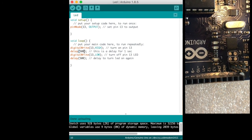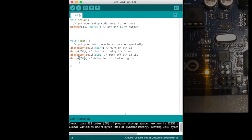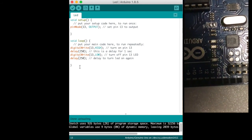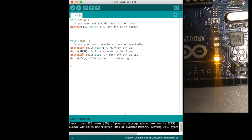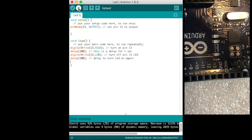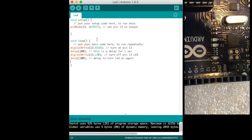Let's go even smaller — we'll keep halving it: 250 milliseconds. I'm going to send this to the Arduino — there we go, it's starting to flash faster and faster. Now I'm going to set it to 100. There we go — so now you understand the simple thing about delays. I'm going to upload this and send it to the chip — there we go, see now it's blinking really fast.